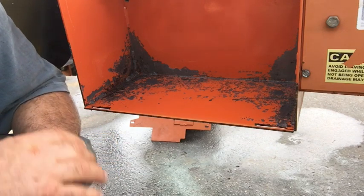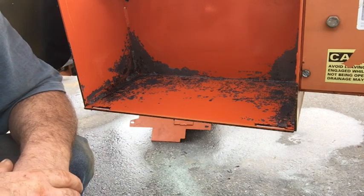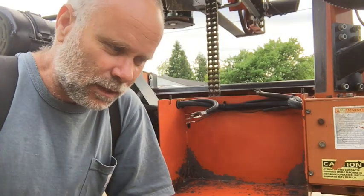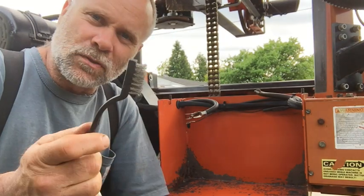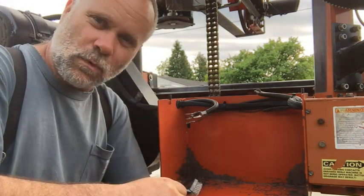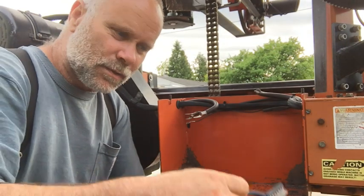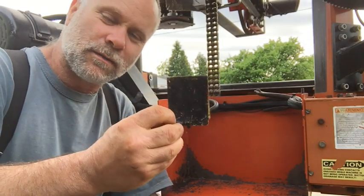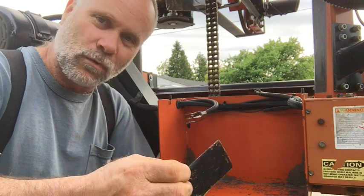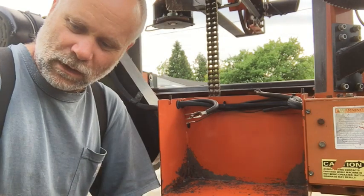So everything is still really solid here. There's no real big issues. The welds are all good. So I went back and forth with a combination of a steel brush. I got this little steel brush here that works really good for getting into the corners, so I use this quite frequently. I used emery cloth, the wet dry sandpaper. This is 200 grit sandpaper, and you can utilize this in moist conditions or dry conditions. And so I did some sanding. I used that air hammer.